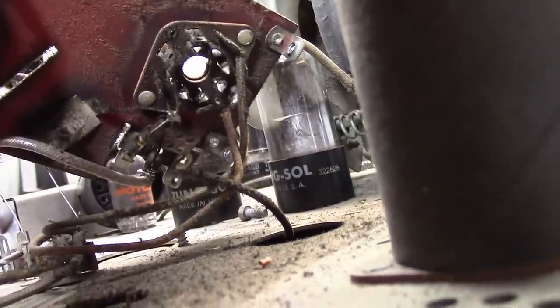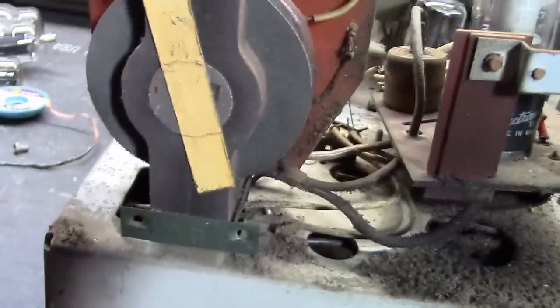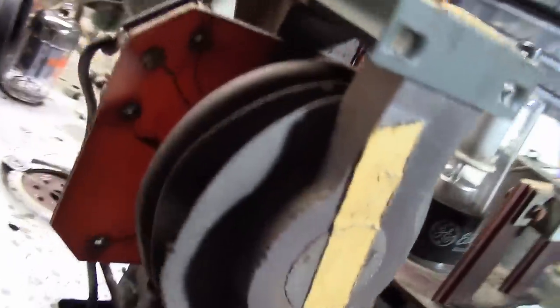I don't think there are any components under here. There may be a current limiting resistor in the middle of all that, and there are a couple back there — a damper tube and one mica cap. Flyback looks to be in fine condition. No cracks or anything on that wax donut.